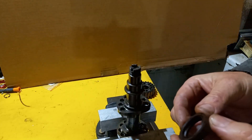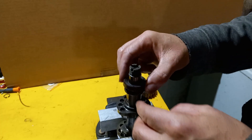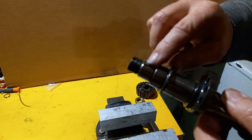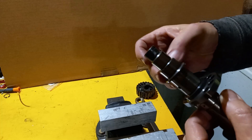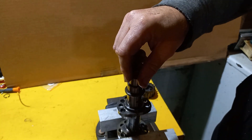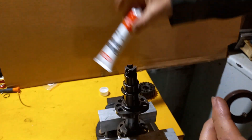Then we can get the seal off. The seal's feeling pretty loose on there. This has a keyway here to hold the drive pulley on. That's where the seal runs and it looks all good — the seal hasn't cut into the shaft. So we'll get the new seal.